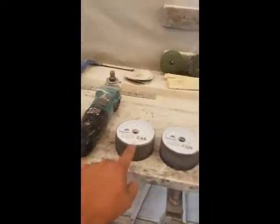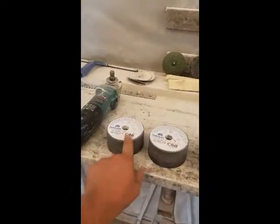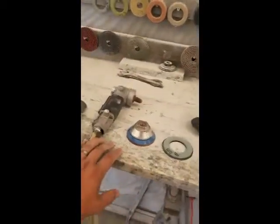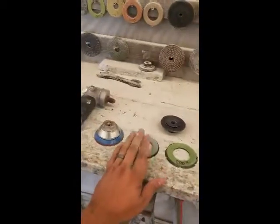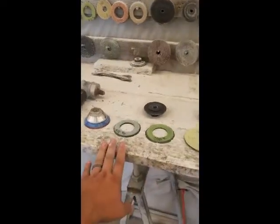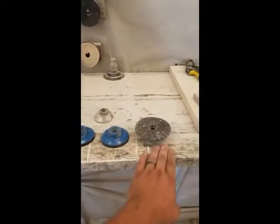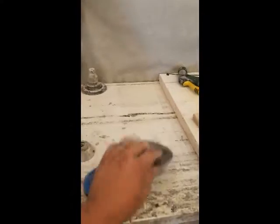We'll use our grinder and three grinding stones to get that flat. The most aggressive starts with a 46 to 120. Then we'll glue it and sand it, and then we'll get our wet polisher and start at a 200 grit, then move our way up to 400. If you wanted a honed finish, you'd stop right here at 400. But we want a nice shiny polish, so we're going to go to 800, 1500, 3000, and then go back on all our flats, do a 2000, 3000, and finish with a buff — which is about a 3500 to 4000 grit pad — and put it on everywhere.